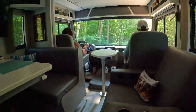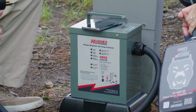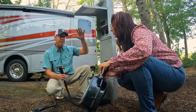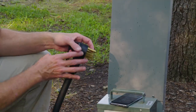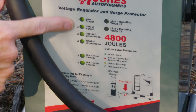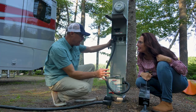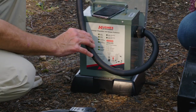We arrived at the campground, and I thought it was a great time to show you how to hook up the electric. So this is a line booster or line conditioner — they call it the Hughes Autoformer. It boosts always 2%, but if it ever drops to where it's dangerous, it boosts at 10%, and that's really the value in this. Plug it in. Everything is green — line one, line two, grounding, neutral. Any polarity issues, any grounding issues, this tells us. All right, good clean power.